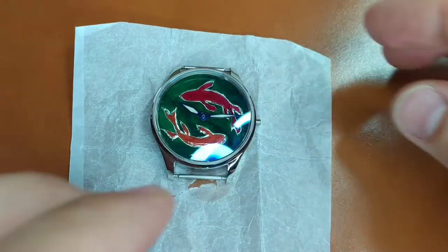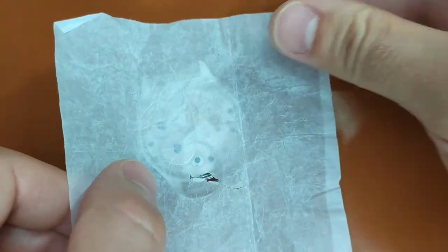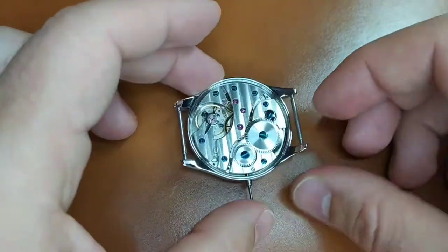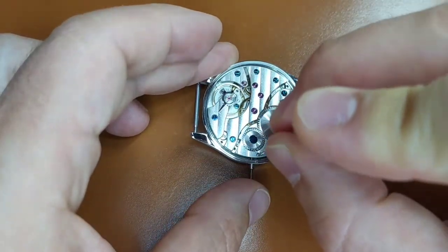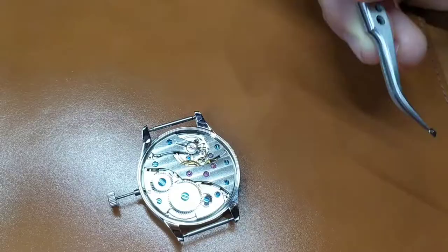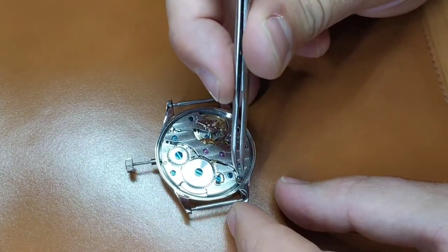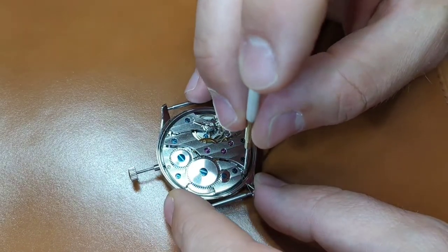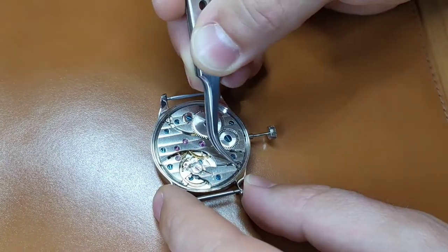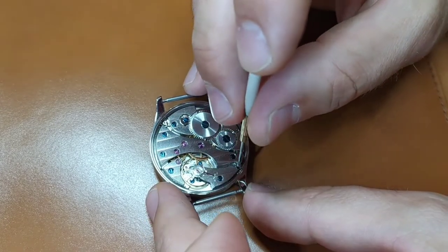Now we can easily encase the movement and the dial. For this I usually use the same protective paper that I used for dial protection. I tried to keep the dial's edges thin in order for it to fit in this small case, but I was not entirely sure that their thickness is suitable for this case. So, in case you can't put the mounting screws properly, then your dial is thicker than it should be. You either have to file off a bit of the paint at the dial's edges, or buy a suitable watch case that can accommodate dials with larger thickness — but as a result the watch case will be much bigger.